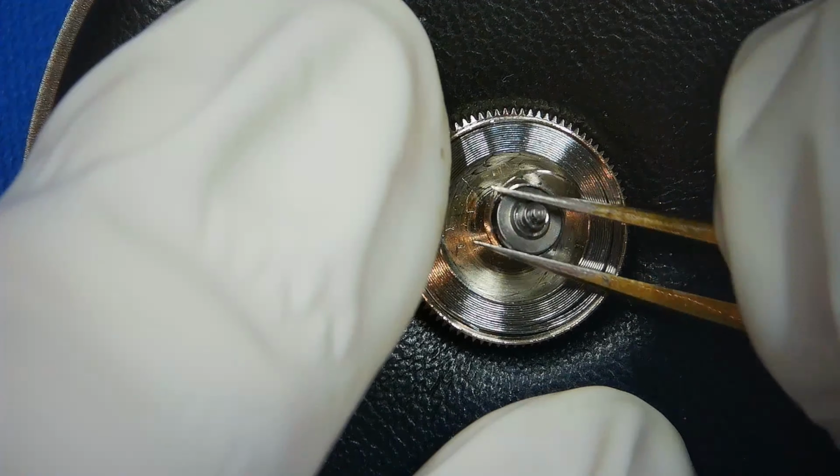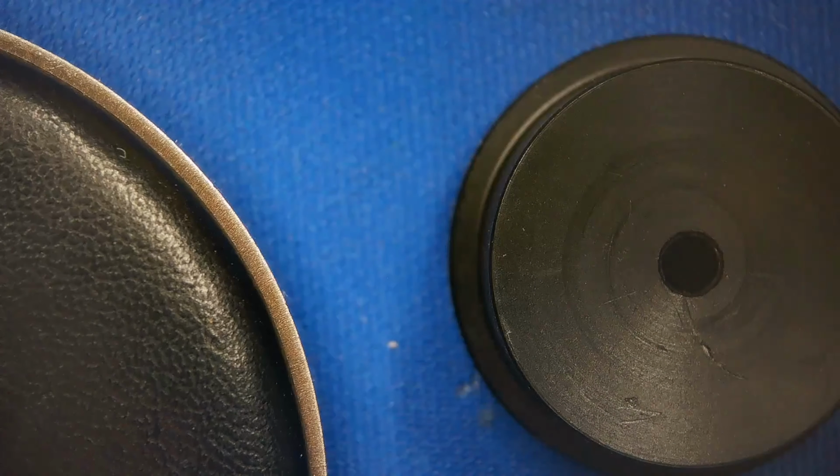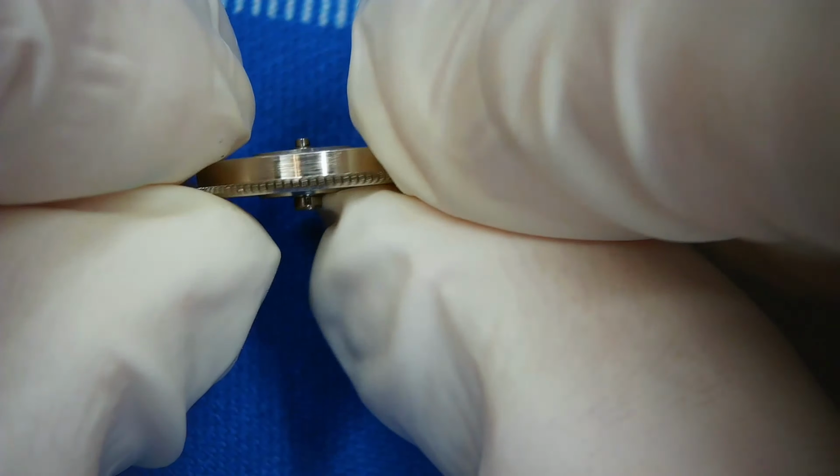So here we're putting 8200 down, and that'll help lubricate this spring. It will also help lubricate the top of the barrel cap, that way it doesn't wear it out. And then I like to put some on the friction points where the barrel meets the arbor. That'll keep it from wearing out.